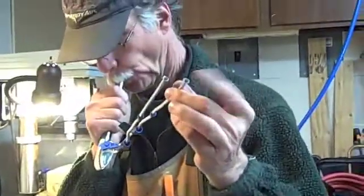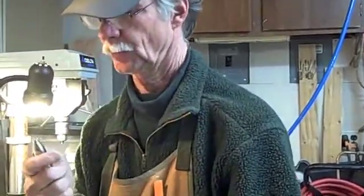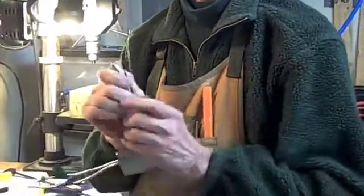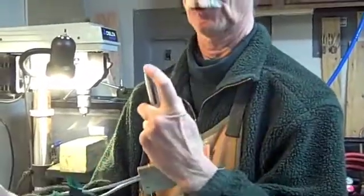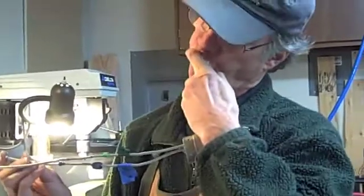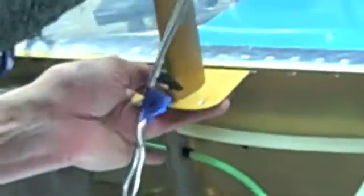Yeah, make sure it still works. This is the pitot tube — make sure nothing's happening to the other one. And then this is the angle of attack tube. I'll blow into there. I color coded them so I know which is which — the blue is this one. And that's still good. You have to do all your bends with a special bending tool so you don't get it kinked. But it's looking to me like it isn't going to be too much coming out of here at all.